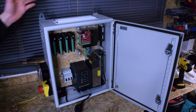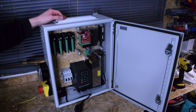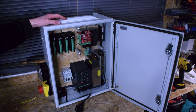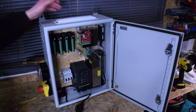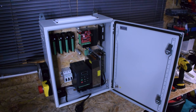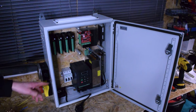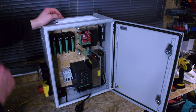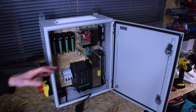Right, so it's completely sealed up. It's starting to look really, really good. There's not an awful lot left to add in here other than just wiring everything together. I'm going to go ahead and do the wiring now for the power electronics. I've got some spare solid core Twin and Earth cable here. I've got my live and neutral and my earth, which I'm going to sleeve. I'm just going to put a few terminal blocks in there — mostly for neutral and earth — then wire all the lives up to where they need to go, and the switches to the fuses and to whichever device they connect to.